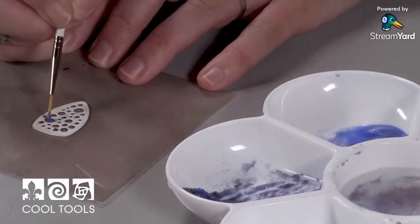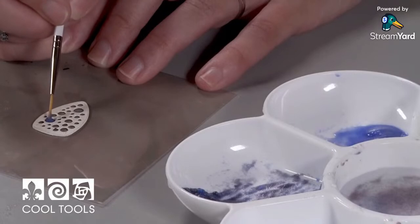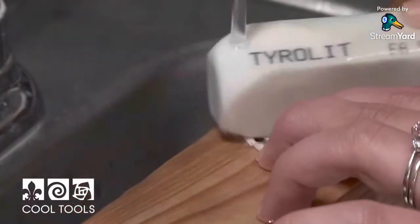First, we will be cutting our pattern into fine silver precious metal clay, which is a huge time saver from the traditional plique-à-jour method where you're using a handsaw to pierce out the shapes that you want to fill with enamel. Then, once we've fired our fine silver precious metal clay, we're going to enamel these earrings by wet packing enamel into the cells that we've created. Finally, we will be stoning and sanding the surface of both the enamel and the metal to bring it down to one smooth, even surface.